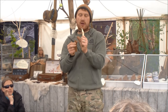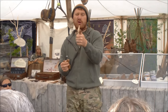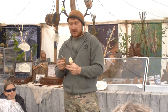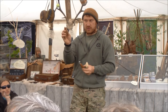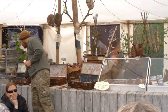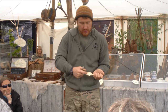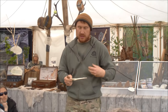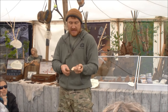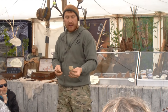The best size for an eating spoon — even this one is too big. Look at a favorite metal spoon from your cutlery drawer and use that as a template. When learning, if you go straight to a massive crook knife you'll fatigue quickly trying to remove too much material at once. Choose something with not more than about an inch diameter radius — almost the size of your thumb. You can always do bigger projects with a small knife but you can't do a small project with a big knife.